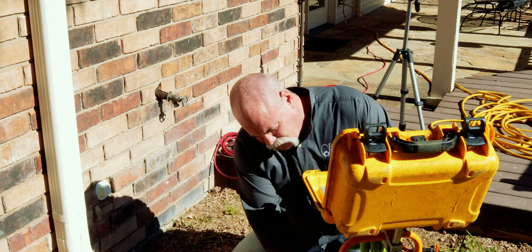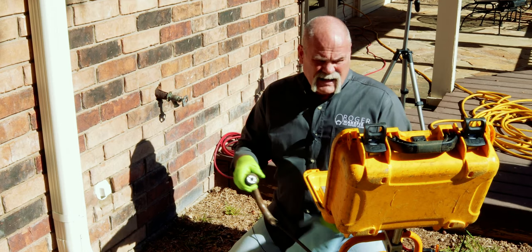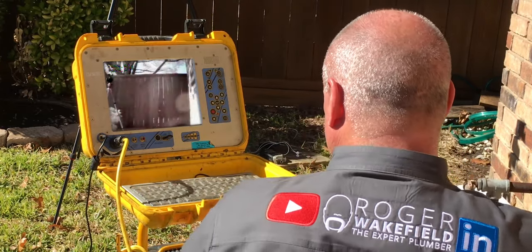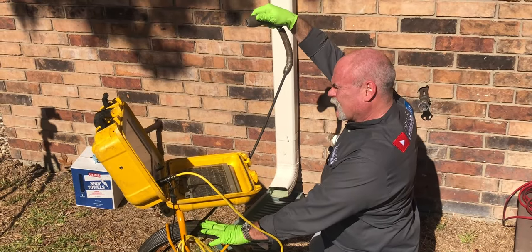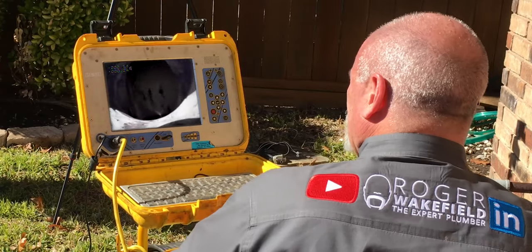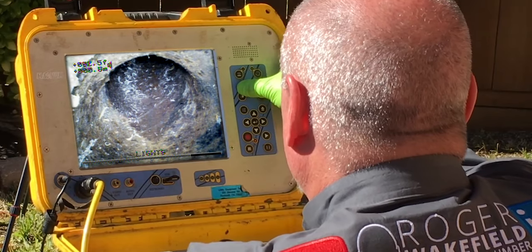This is a three-inch plug, and we're going to run the camera in it. I've still got my head on, and since this is a three-inch line I can leave it on. I'm making sure my camera lens is really clean so I can see things well. I'm recording and I like to zoom around the backyard to show people it's their house. I've got a self-leveling head, and I can see from looking inside there's PVC pipe.